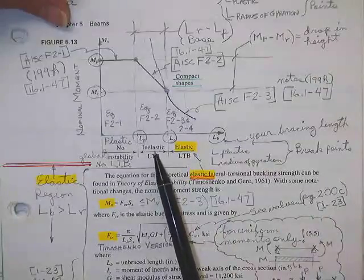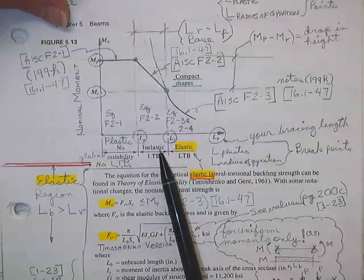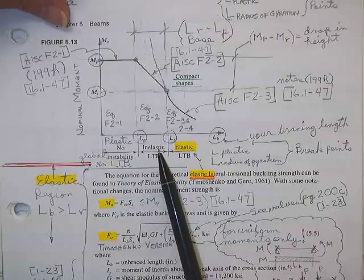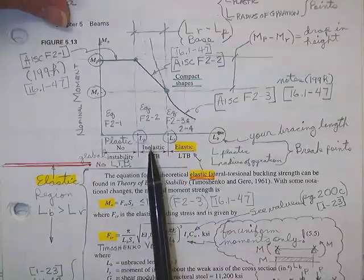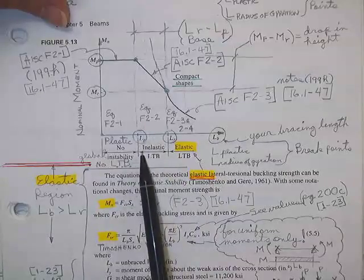No, no, it's going to buckle. It's going to buckle laterally. The only thing is, once it buckles, maybe the load roll falls off because it's kind of buckled. Well, when it pops back, and it will, then it'll pop back bent, because you have plasticized some of the fibers.